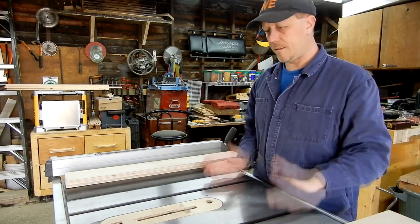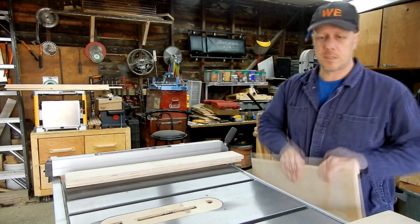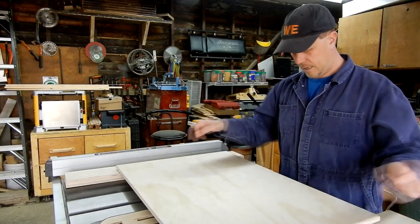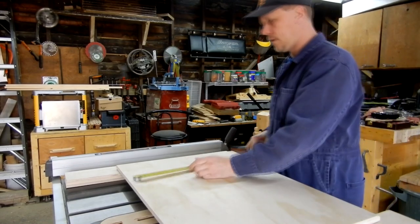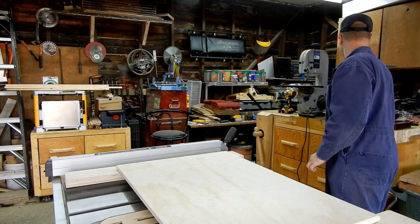They're going to go about 400 thou into the plywood. I'm going to use three-quarter plywood - it's not Baltic birch like everybody else uses. I don't have $80 a sheet to spend on Baltic birch, so this is laminated pine that I've had hanging in the shop. As for size, it doesn't matter - you can make a little mini sled or a big sled. I decided to make one that is roughly twenty and three-eighths by thirty and a quarter.